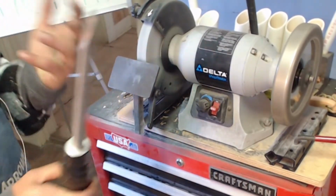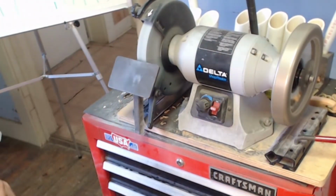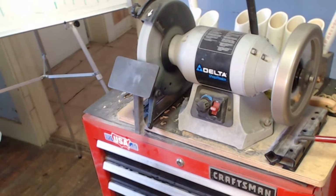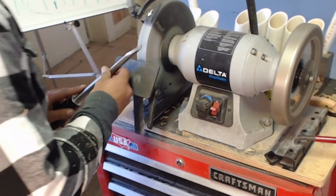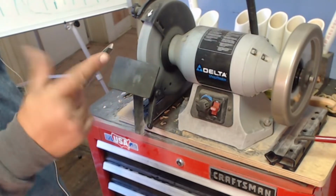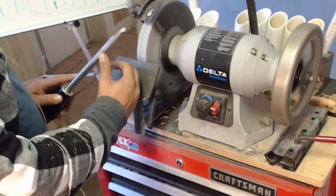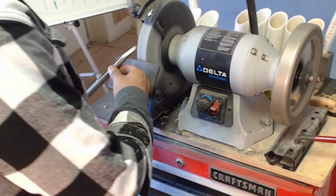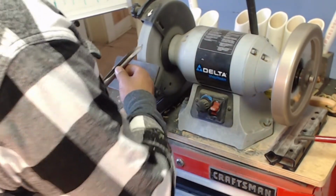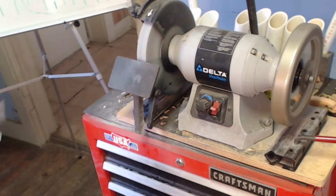It doesn't matter what side you grind first, but typically if I'm going to grind the left wing of a bowl gouge, I'm going to start with the left hand. I'm ambidextrous. I'll do it with the left hand first, like this. What I'm doing is pivoting with my right hand's fulcrum, right in here, just the fingers right there, and grinding it this way. I'm basically finding that angle, bringing it around. And I'm typically testing to know exactly where I'm at, just with this guy right here.